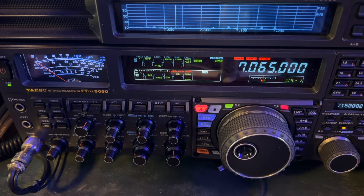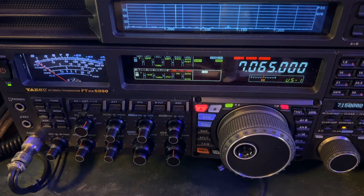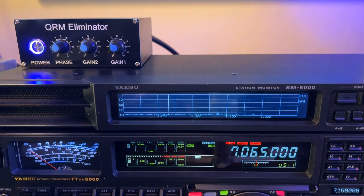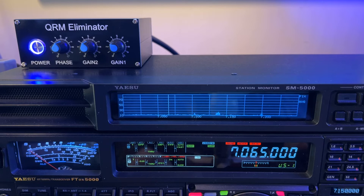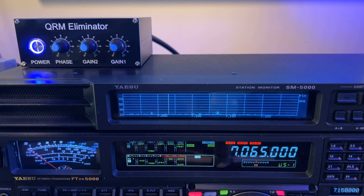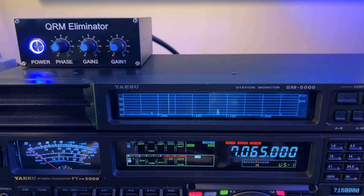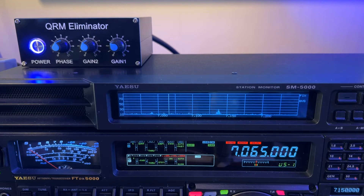Okay, let me get up here and log that real quick, and I'll tell you what changed. So this is the QRM eliminator up here - you know that I normally use that on sideband, and that is a typical application for it to reduce pulse noise, pulse-type interference, because you can phase cancel. In this case I was just using it to reduce a little bit of attenuation but also phasing out some of the atmospheric noise.